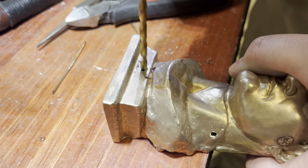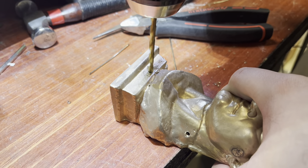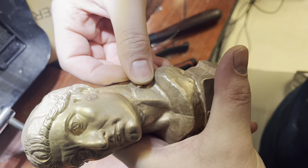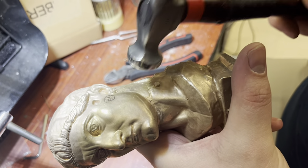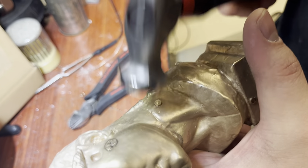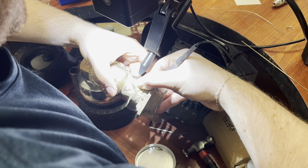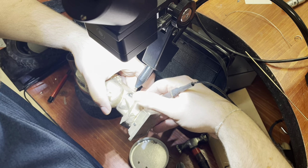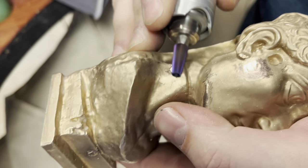Once cast we had the job of taking care of all of those small holes and filling them back in. We had some sprues from a previous cast laying around so we drilled out the holes to the exact size and countersunk them, creating small bevels for the weld to fill. Once hammered in place we could then weld and blend them away. As a client commission, this particular client wanted the pieces to have a high polish finish. For those that haven't seen our three-part series on filing, sanding, and polishing, I would definitely recommend checking that out using the link in the description down below.